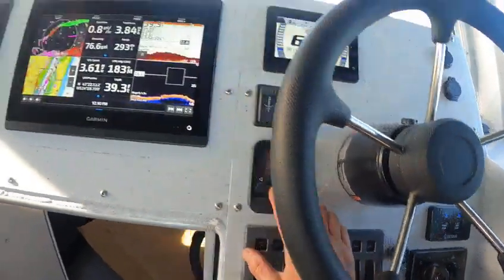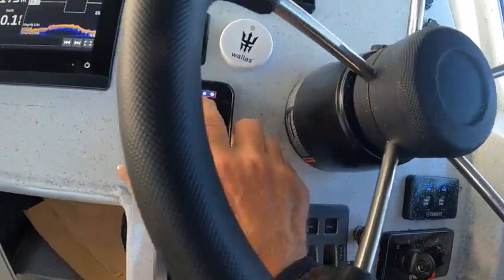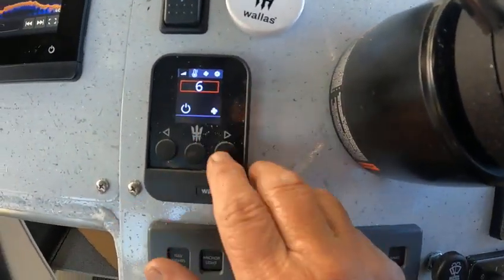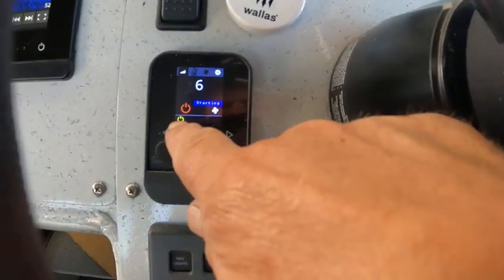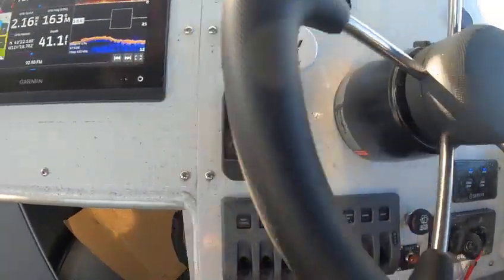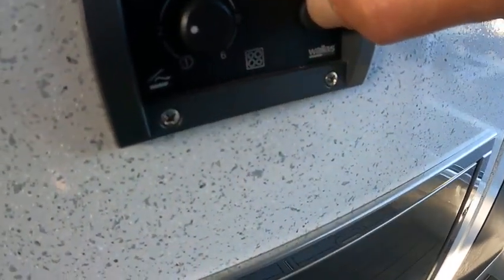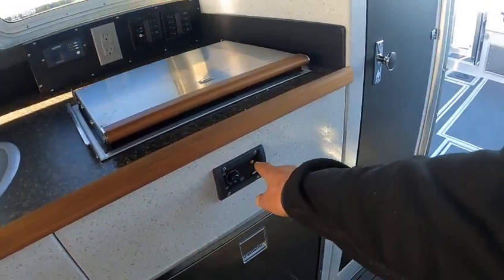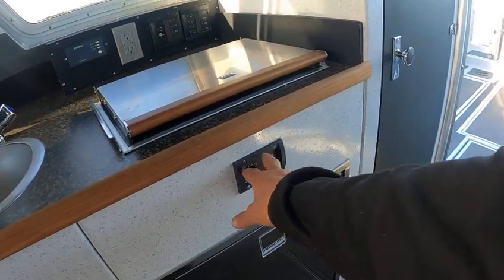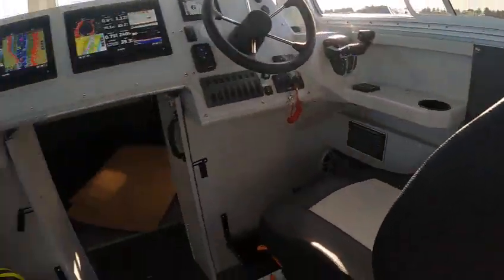That's your waste pump, heater. Okay, here's where we go on this one — see what my depth is: 40 feet. You hit that, see how it's highlighted right there, then you hit this button until it goes down here. Push on it — long press — you're going to see this and this, that means it's trying to ignite. You'll see flames when it ignites. Then go over here, turn this pump off on this one, hit this until it just lights up there, then leave it alone. It doesn't matter how far you go — it ain't going to warm up any faster. The yellow one's going to stay there when it ignites, and those two will stay on steady. If it blanks, that means it probably went into a reset.